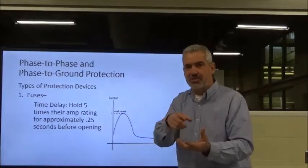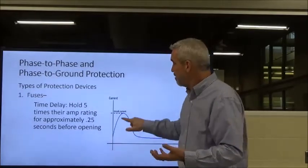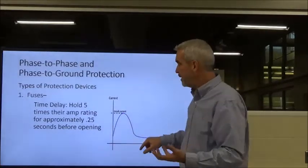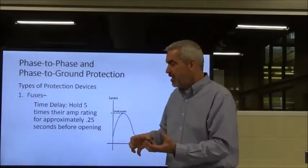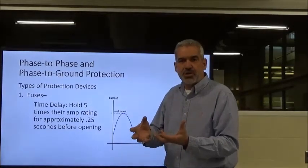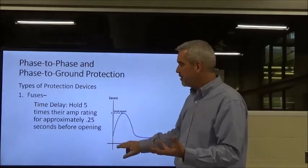And the faster it spools up, which most of you have seen, motors spool up very quickly, that current starts to come down very quickly too. It comes down in correspondence with the rotation of the rotor. Likewise, if we load a motor up, if whatever we're turning starts to cause the rotor to want to slow down, our current will go up. But right now we just want to deal with the inrush current.